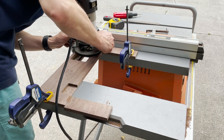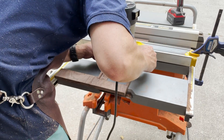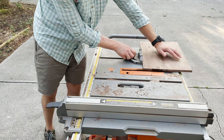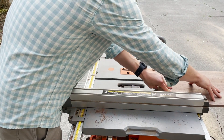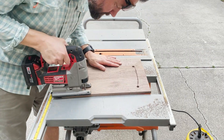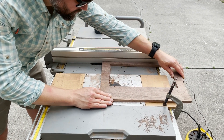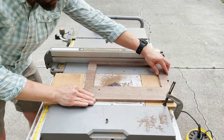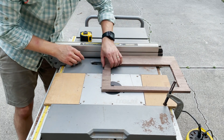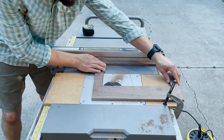Next I had to get the false floor ready for the analog-to-digital interface. I used the Audient ID4 for this build because, in my opinion, it is the smallest, most well-built interface with the best preamps for the money. Don't let the fast video fool you — this took a while. I settled on a portable Pixio monitor to install in the lid for the graphic display. Same concept: use a jigsaw for the big cuts and then use the router table to clean everything up and give a nice straight edge. I'm using the fence on my table saw, which I also use as the router table, to keep everything good and straight.